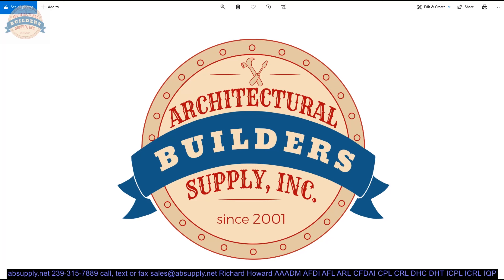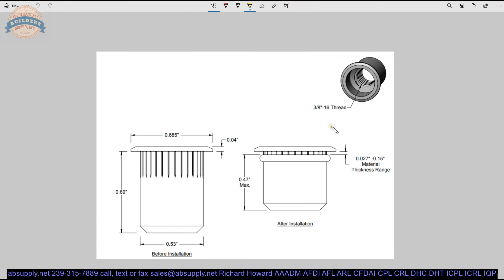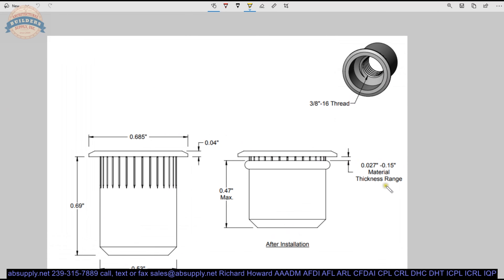Let's switch back to the screen view and take a closer look at the technical drawing. All the dimensional properties beyond what I've shown — material thickness: 0.027 to 0.15 inch — and that's going to be clearly for your aluminum storefront or hollow metal doors. I wouldn't say this would be superior to a through-bolt, but also not to a drilled-and-tapped installation. If you had adequate reinforcing and drilled and tapped to that adequate reinforcing, the pull handle should do pretty well.